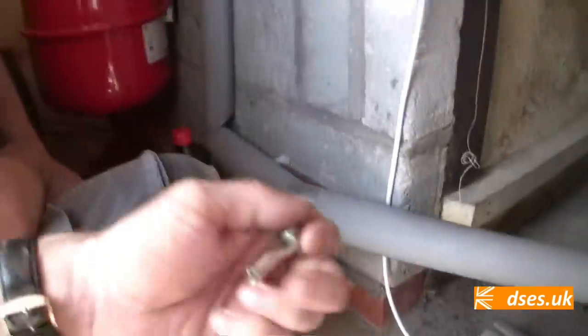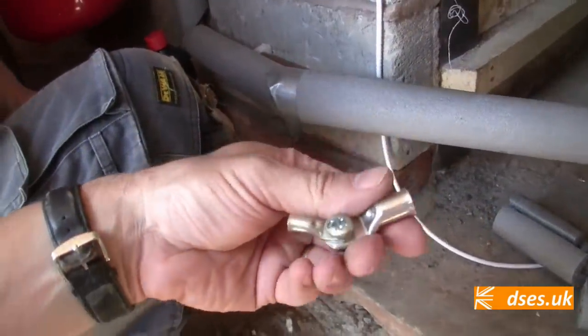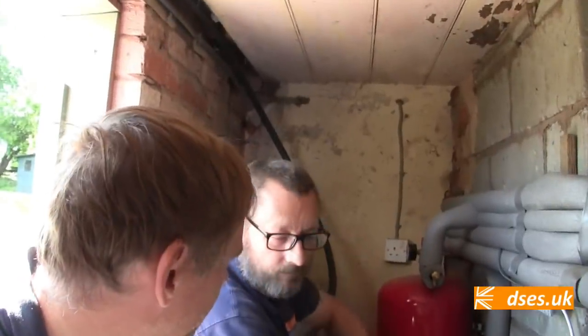Yeah. We're not going to be using anything like that out there, but we're making sure that we're sending a beefy supply over there, so that whatever happens in the future, there's a beefy supply. In the torpedo itself, obviously it comes with butt crimps. We're not going to have to butt crimp down from a 35 to a 10. So our super solution is this arrangement where we use crimp lugs to reduce the CSA. We're going to bolt them together within the torpedo, fill it with a resin so that it hardens. And once it's hardened, those screws are never going to undo again.